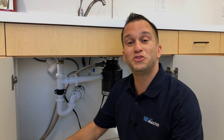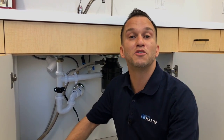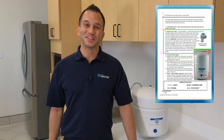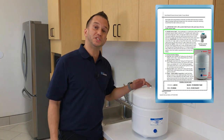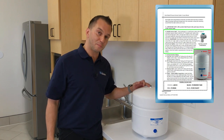And there you have it — you've successfully completed Part 4 of the HomeMaster reverse osmosis installation videos. Please continue on to Part 5 for step-by-step instructions. We're now going to install the tank. Using an eyedropper or a small spoon, we're going to place two drops of unscented regular bleach inside the ¼ inch stainless steel water nipple located on top of the storage tank.